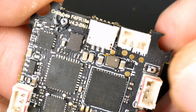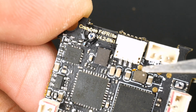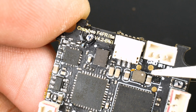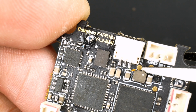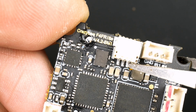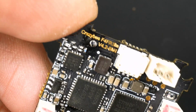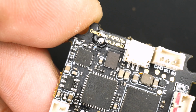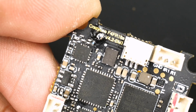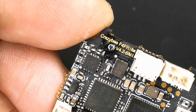One of the other things we'll need to do is get to the 5V pad. You can see there is a 5V pad right down there and the ground pad is right here. Now I don't know if I can get into that 5V pad. I've checked that this 5V pad is sharing the same regulator as the 5V pin for the camera. Propsoff said you can wire it to this 5V pad. I don't know if this BEC would handle the current drawn by both the camera and the VTX, but I'm going to go by his tutorial. Hopefully it doesn't blow anything up.